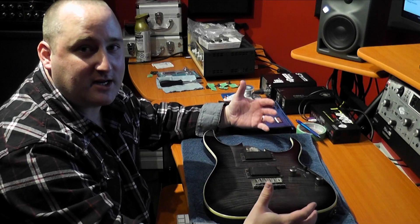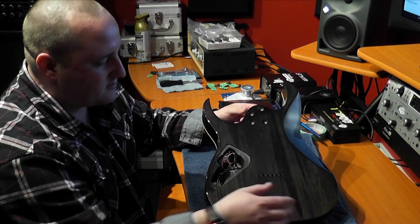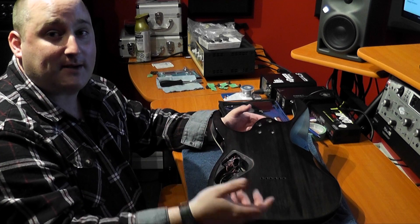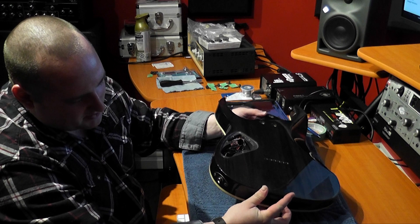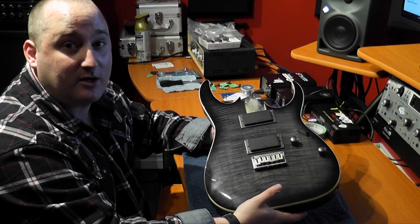As you can see here we have the body all laid out. The neck's off it because we refinished the neck. I just took the back plate off so I can unsolder the pickups and take out what I don't need out of this guitar for when we put the new pickups in. We're going to keep the pots, fix up and paint this jack, make it nice, and clean all the screws and hardware.